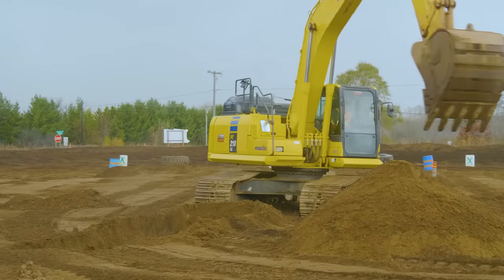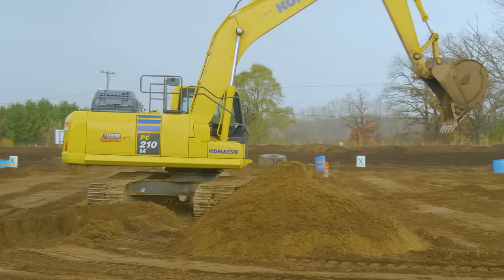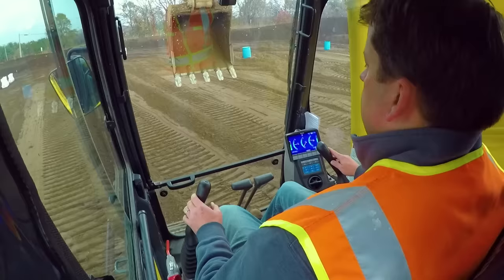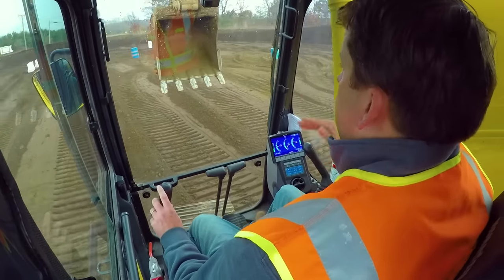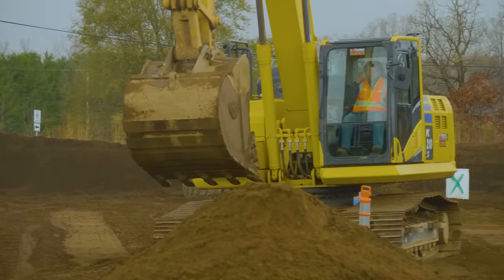As much as possible when you're driving, if you can swing left, that's safer because you can see as you're turning. I'm not going to go deep into traveling position — there are a lot of different schools of thought on whether you travel with the stick low to the ground or tucked in for overhead clearance. That's a debate and everyone has their own preference. But generally, either have your bucket lower to the ground or be completely tucked in.